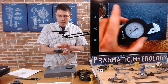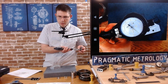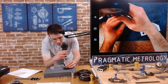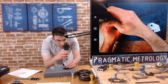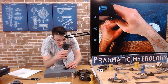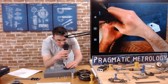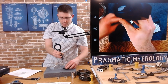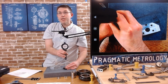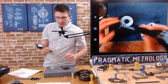So normally I would be looking dead on, kind of eyeballing it for now, so you can see it on the camera. I'm pretty close. I'm going to finish it looking at it dead on. All right, I'm about 2/10 off. And I rotated it too far. That's not unusual. All right, I got 0. Hopefully you can see this on the front camera. The inflection should be over to 0, although it's hard to say if I can't see it. So trust me, when I'm looking at it, it's at 0.